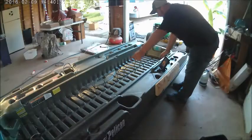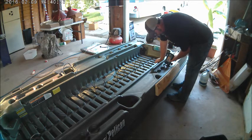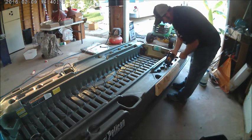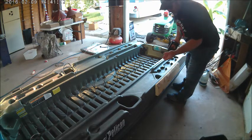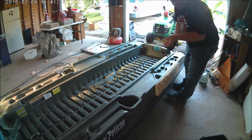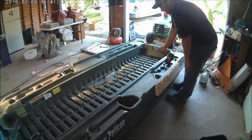Once I get the wire ran down in the center of the boat, the fish finder is probably gonna go here, like this little cup holder, or here in this spot. Probably what I'm gonna do is screw that in here, but I want to pre-drill them first and put those plastic inserts in. Once you're on the screw it kind of tenses up to keep it from pulling out. That should put it in a pretty good area.